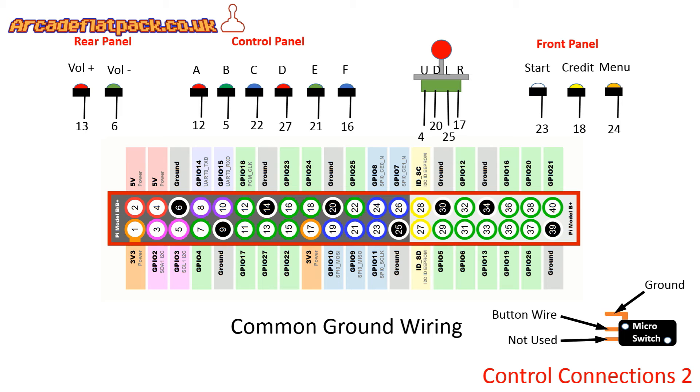Making note of these connections, if you're using our image, simply wire your remaining button connection from each microswitch to the indicated GPIO pin. Make sure you don't get those mixed up with the pin numbers. Then you'll be absolutely fine. This diagram works for the Raspberry Pi B+, the Raspberry Pi 2, the Raspberry Pi 3, the A+, and also the Raspberry Pi Zero as well. Connect each of those to the corresponding GPIO pin, and using our image, that bit's taken care of. You should be able to copy our image to your SD card, boot up your machine, and you'll be good to go.